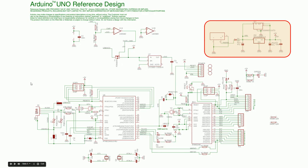Now here's the official schematic showing how the Arduino works. It looks very complicated until you break it down into pieces. This section up here has to do with the barrel plug adapter: power comes in and goes through a diode, which protects against reverse voltage — if 5 volts comes in backwards, the diode will block it from going any further.